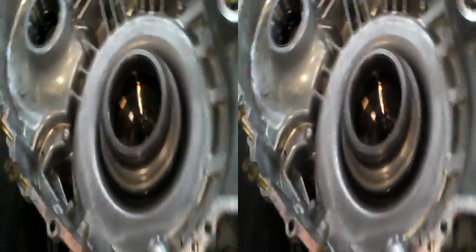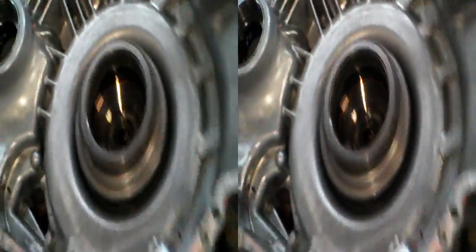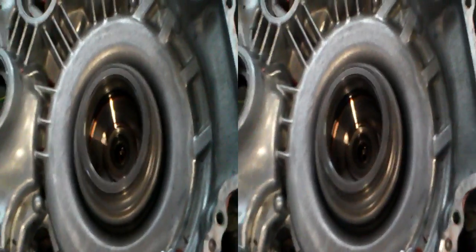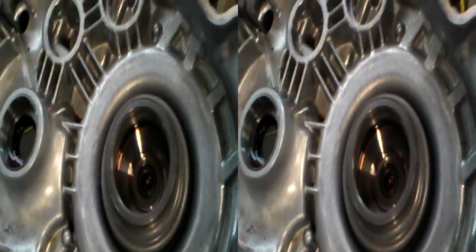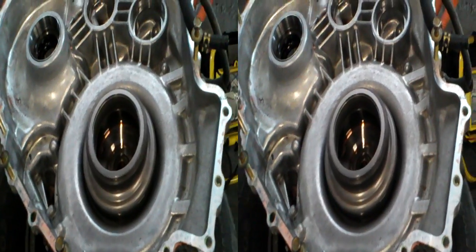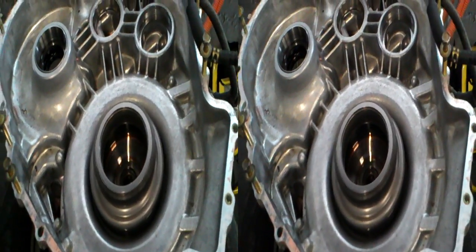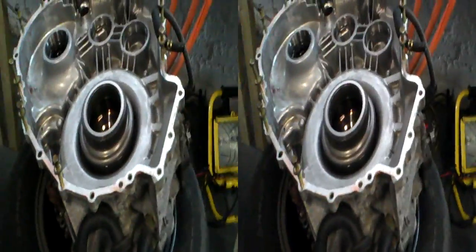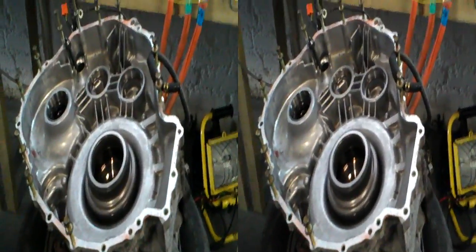In a real situation, if that motor is going at 1.2 rotations a second and we're gearing it down around 10 to 1, that means 1.2 rotations a second would translate to 0.12 rotations a second. So if we say it's about 1 a second and divide by 10, the wheels are going to be doing one rotation every 10 seconds.